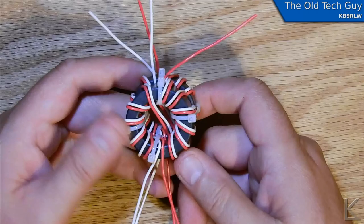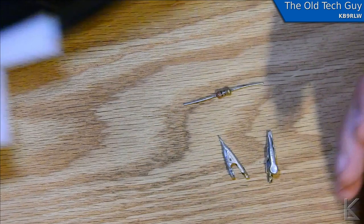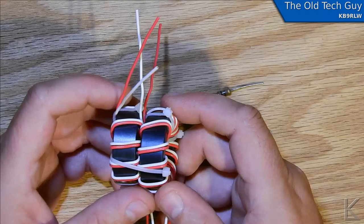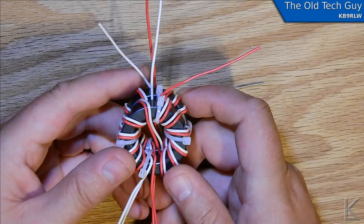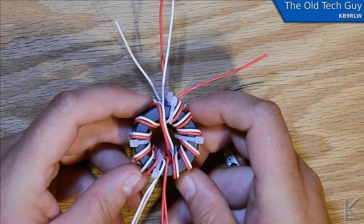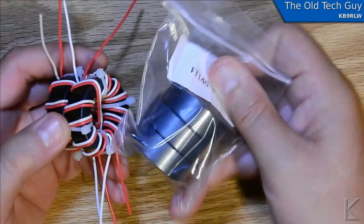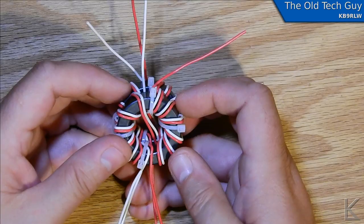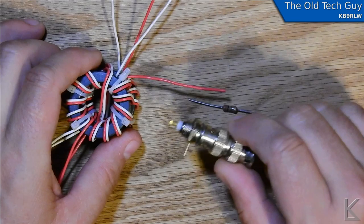After the VNA scans I'll put the type 43 balun on the antenna and do another comparison — both antennas in inverted-V configuration, oriented the same way, with the one not being tested laid on the ground so it won't interfere. If these cores are markedly better for HF, I've got three extra cores and I'll probably wind a 9:1 to replace the one I have in my external antenna box.